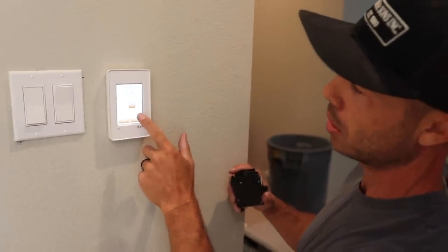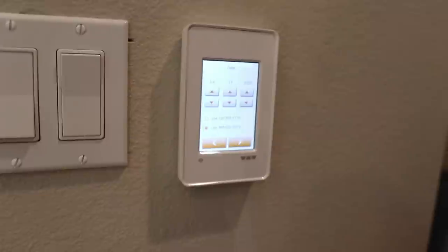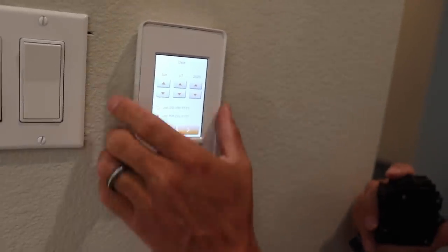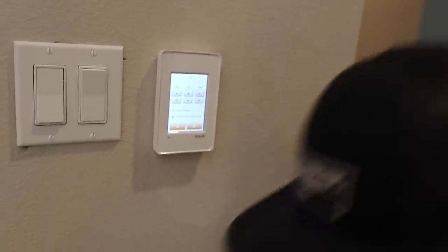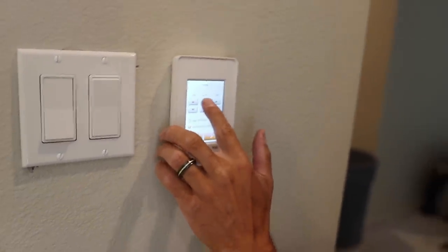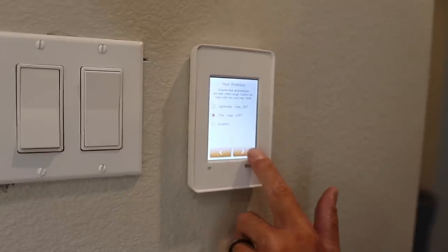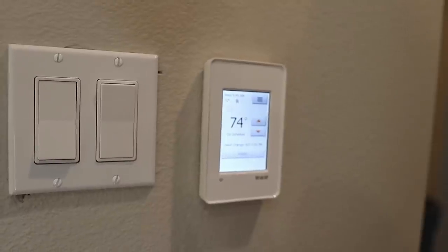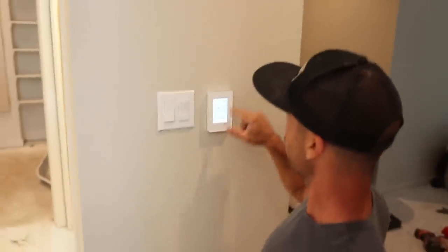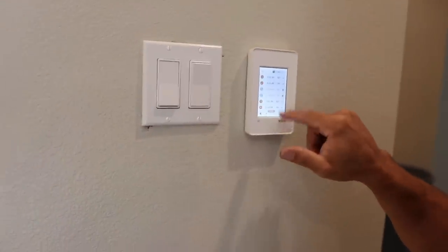There's a little test button on the top. Push that and it says GFCI is functioning properly. If there's a ground fault — say a shower door guy drills into your cable — you'll see that happening. The system does a periodic self-test. We're going to use Fahrenheit. Load measurement is on. Sensor type is 10k ohms. The date is the 17th, time is 9:45. Floor protection max is going to be 104 degrees. Now it's going to start heating the floor.